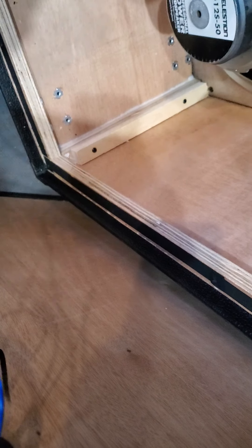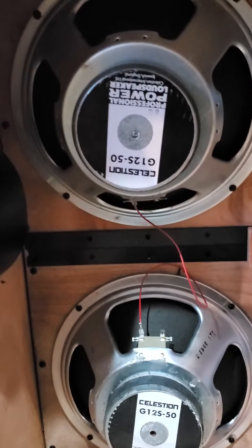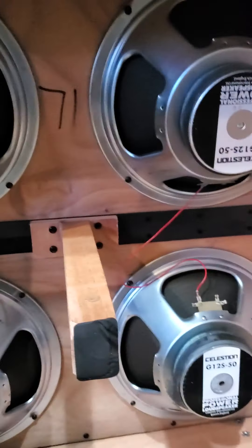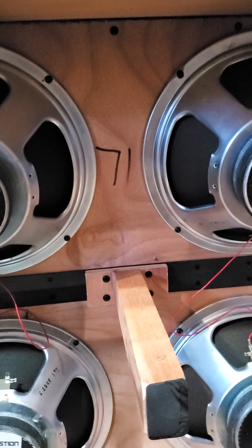The yellow goes to the center and the blue goes to the outside. What you're doing is splitting this up and driving each one of these so they're in parallel with each other. Over here they're in series, which equals 16 ohms, and you'll feed this one and that one from the same input, which means they're now going to cut it in half.